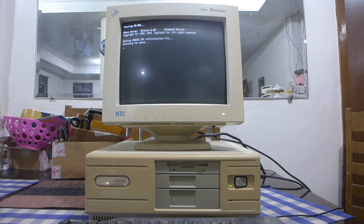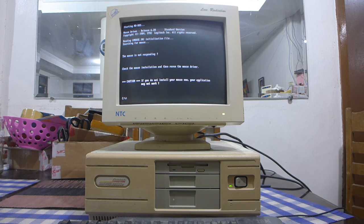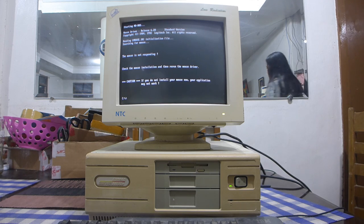Okay. Oh, but I don't have a mouse attached. Okay, but we now have a fully working deskpro that does not need a horribly bodged on ATX power supply to play with. That's how I've tested it originally, and that's why I was able to get DOS on this prior. Because the original hard drive, which is a 120 megabyte Maxtor, was dying. And so I've stuffed in a 210 megabyte Conner drive that was originally meant to go to my 386SX into this machine.